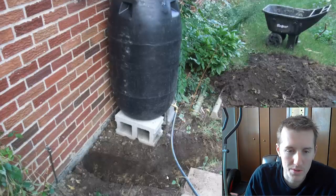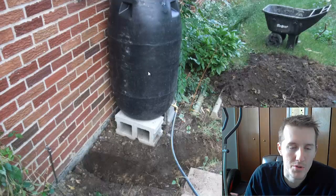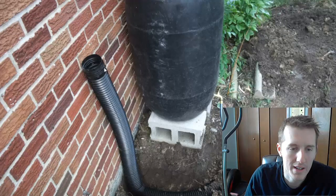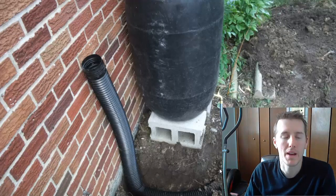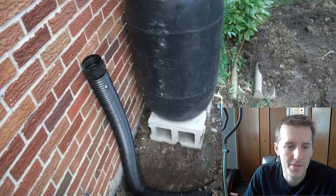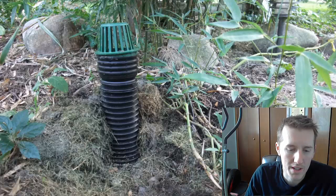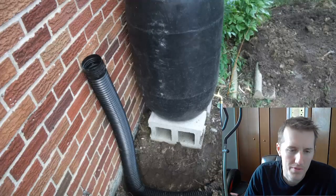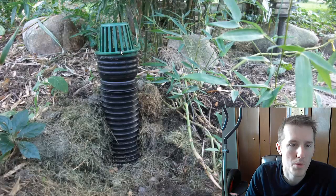The next one I did was draining off my rain barrels — I had an overflow. I bought this corrugated black pipe that came all coiled up in a nice little package from Home Depot for probably 20 bucks, and that worked pretty well. In hindsight, instead of the PVC from the beginning I probably should have used stuff like this — or they have bigger rolls of it. The cool thing is you can bend it, twist it, do whatever you want. It has the holes already in it and you can put the upward spout wherever you want in the garden.